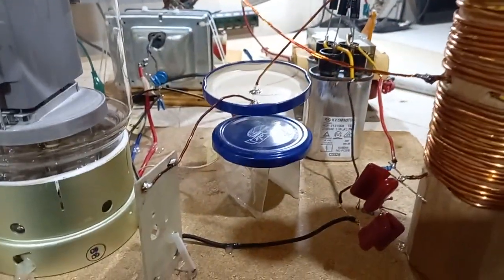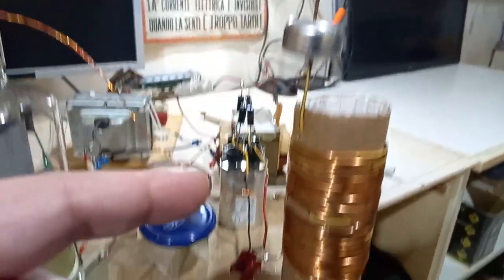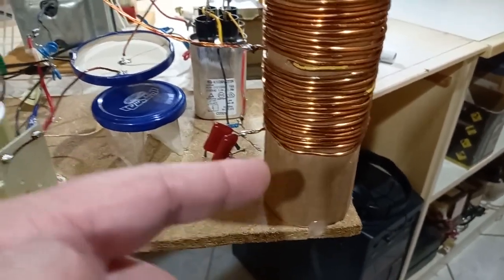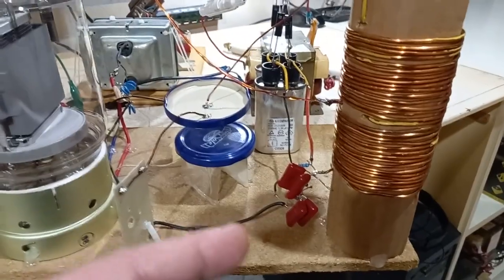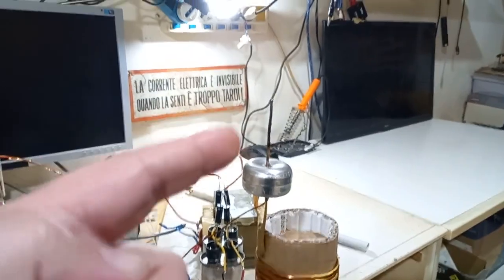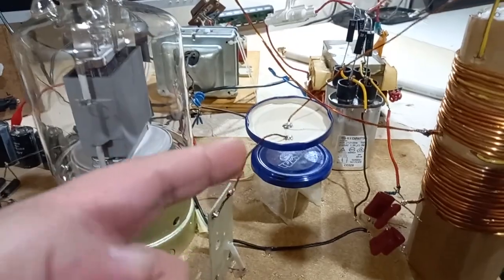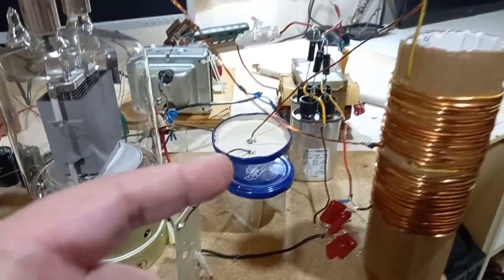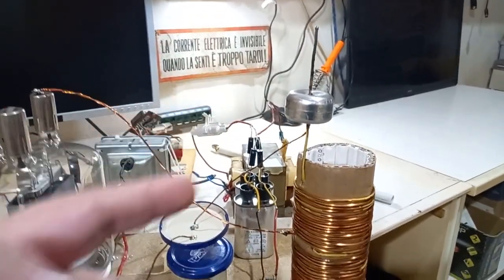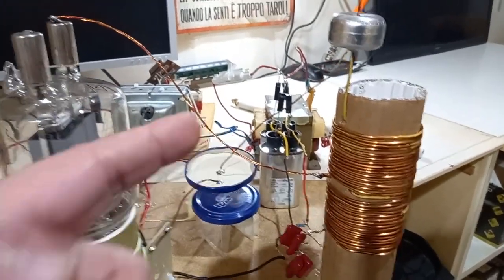For the feedback, I'm using a pickup capacitor on the actual output of the coil — not a base winding — that drives grid 1 of the tube. In my opinion, up to this power level this works best, because when the output voltage is at maximum, the drive on grid 1 will also be maxed. So this system will automatically choose the best resonant frequency and also the best phase for the system, giving maximum performance, and it's quite easy to adjust.